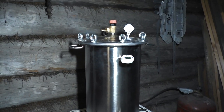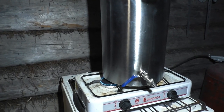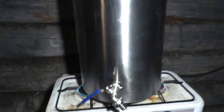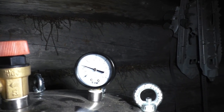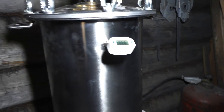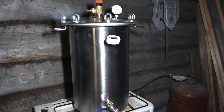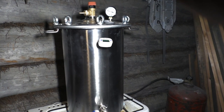Many hours later — this gas burner isn't really ideal for this job, so I had to split the flame so it's burning on two sides. You can see we're at almost one and a half atmospheres and 117.5 degrees Celsius. We'll let it stand for about 40 minutes more, then turn it off and check it tomorrow.